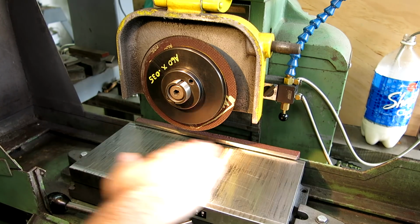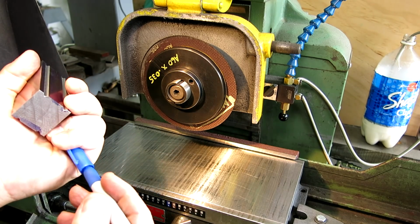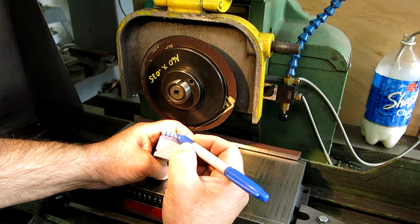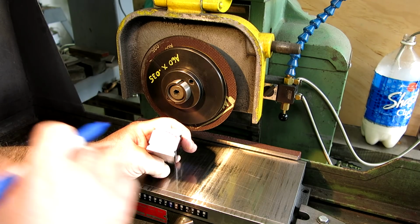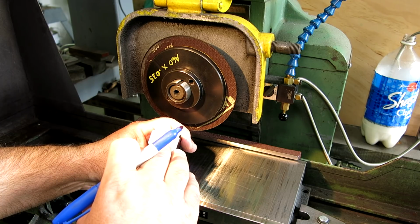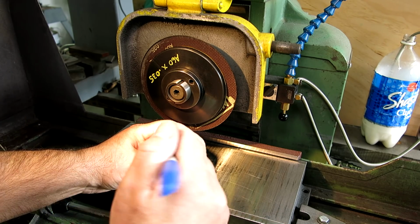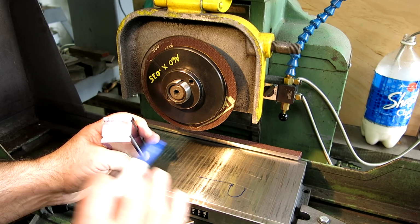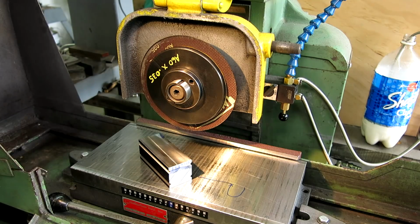All right, so we're going to get set up here to cut grooves on this. And for those of you that soldiered through all the CAD work, you probably noticed that there's a bunch of grooves from the surface down like that, and that's stock on the CEJ Platen. And the idea is that when you're sliding a sample around on here, any dust or anything drops into the grooves, and the edges of those channels are very crisp and sharp, so they just knock anything off and it drops into the groove. So that's kind of the idea of serrated platens.